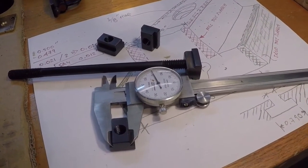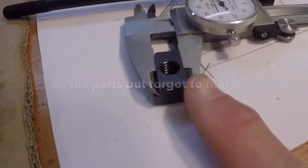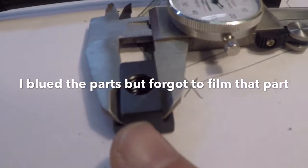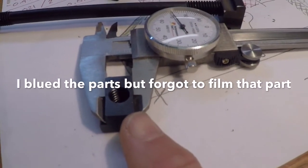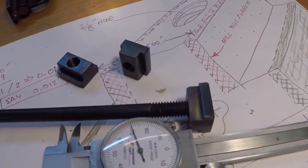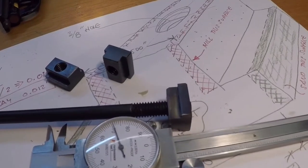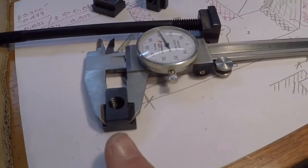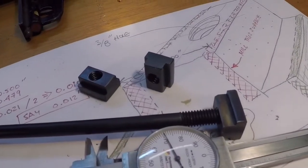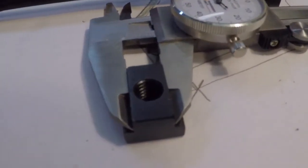The job is done. I'm pretty satisfied with how this came out. I cut the web portion of the T-nuts so they have about a ten thousandths slop fit with the mill table slots. I used the sander to cut the flange portion and just trial-and-errored those until they fit in there nicely. I could have bought the correct T-nuts online probably for just a few bucks, but this is way more fun.